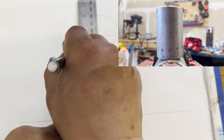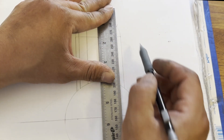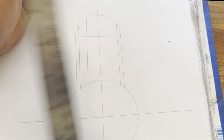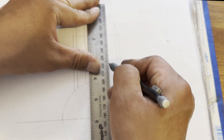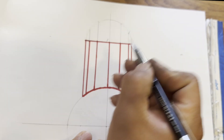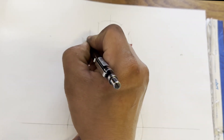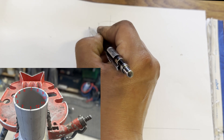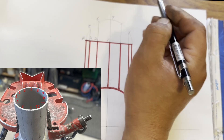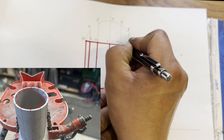You don't need to divide the actual pipe — it is a total waste of time. Next, draw a vertical line from each intersection of the arc to the 3-inch pipe surface, then give a number to each intersection. It doesn't matter where you start numbering. I start at number 1 in the middle and go clockwise. It will be easier to understand if you look at the actual pipe numbering in the picture.